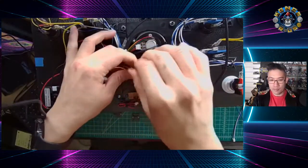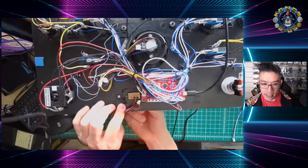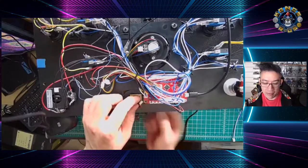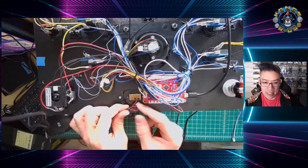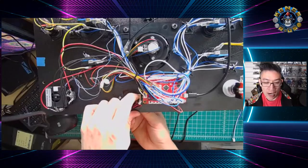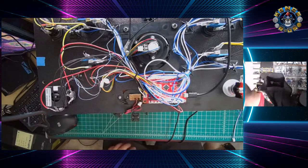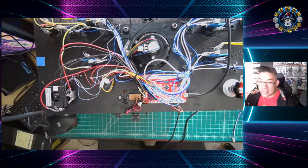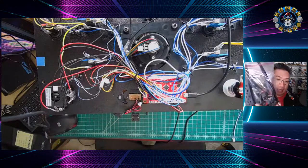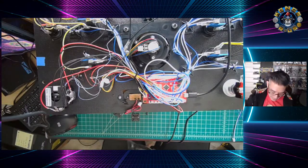All right, so what we're doing is, see, this is the stock power switch here, okay? And then the stock cable is coming out of here. This is already plugged in. I just tied this off. We're not going to be using this at all. We're going to be using the two terminals that are right underneath here, and we're going to wire it into some 12 gauge wires. So in my kits that I provide, this here is an inlet module switch, a surge protector,